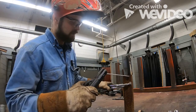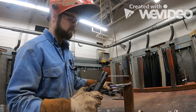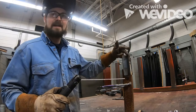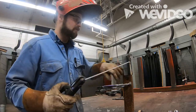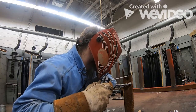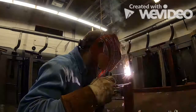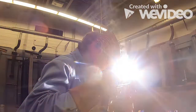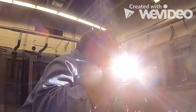Our first pass we're going to start down at the base and work our way to the top. This is a 90 degree T-joint, so our first pass splits it right in half at 45 degrees — technically straight on. We're going to start here at a 5 to 10 degree angle pushing up, keeping our electrode nice and close into the puddle, about a sixteenth of an inch away. Remember to raise that elbow as you go up — that'll help you keep your angle.